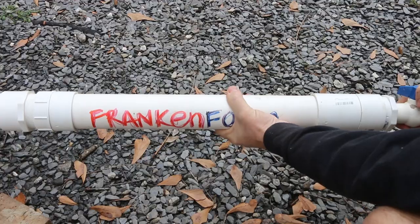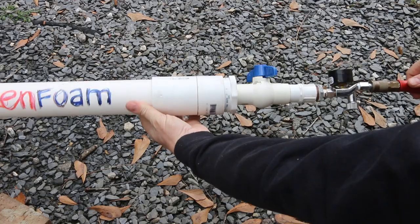So I'm going to make March the month of AirCrete. My goal is to figure out what I'm doing wrong and start doing it right, and then make a couple of projects from the material. For my first video today I'm going to get my foam density right. I've done some research and I know what density I need to look for, and I suspect that Frankenfoam, my foam generator, isn't producing quite the density that I need. So I'm going to test that out, make some modifications, and then hopefully get some foam created correctly — and then with that foam I want to make some AirCrete blocks.